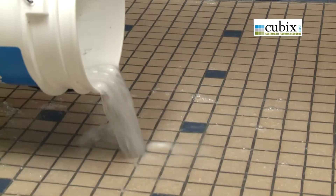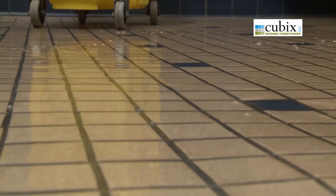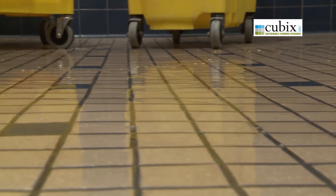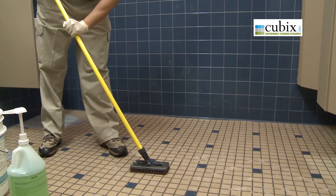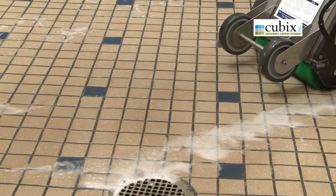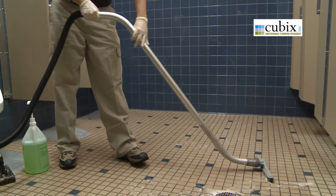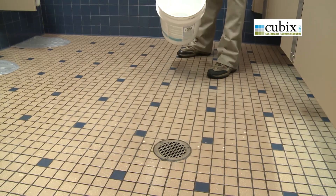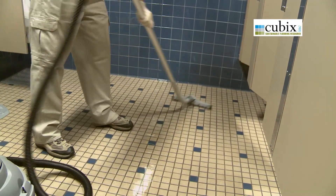For heavy weekly, bi-weekly, or monthly care, we recommend the following. As always, sweep or vacuum loose dust and soil prior to starting the cleaning process. Flood the tile floor with a neutral cleaner. Be sure to follow manufacturer's dilution instructions and that the entire floor is covered with water. Allow to sit for at least 10 minutes, but no longer than 15 minutes. Scrub the floor thoroughly with the deck brush, or for larger floors, a medium power scrubber with medium brushes. Use a wet vac to lift all soiled water from the floor and rinse with clean water poured from a bucket or other source. Once again, remove rinse water with a wet vac.